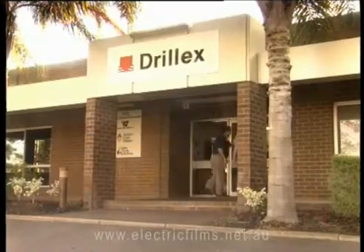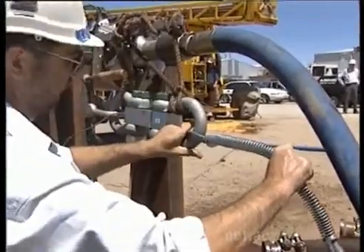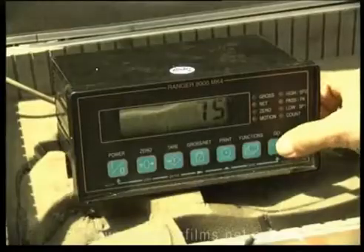The first test used two-inch hoses with sling-type whip checks, which were attached to a tension load cell on the test rig. This was connected to an electronic force indicator, programmed and calibrated to a resolution of five kilograms.